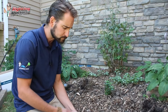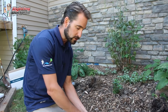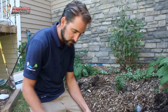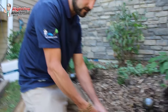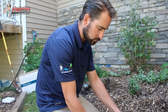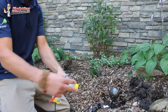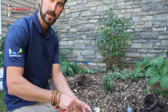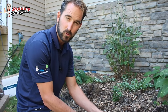You want to make sure you still have two connections at every single fixture, even the last one. The only thing is on the last one you're going to have an extra hole. Sometimes if you know you're probably going to add another light down the road, you can always run another wire out to the field and end it with two of these connectors. Make sure when you do that, you run your 12-2 wire down the line and cap it off so no water gets in it. When you're ready to add a light later, open these up, plug your fixture in, and add that extra light. Again, last light on the line — you still need two connectors; there's just going to be an extra hole in each.